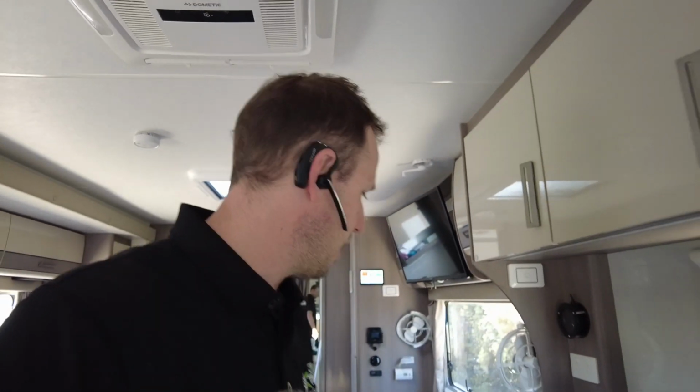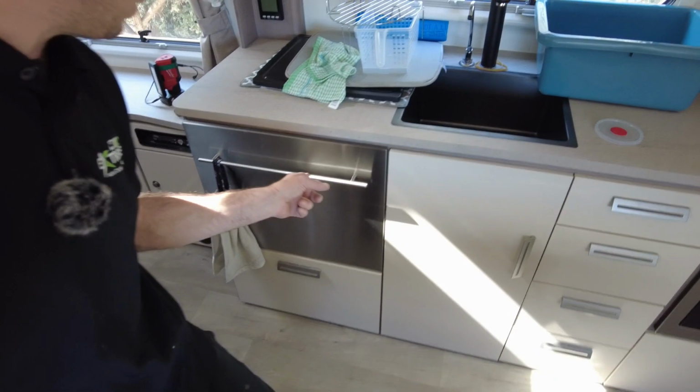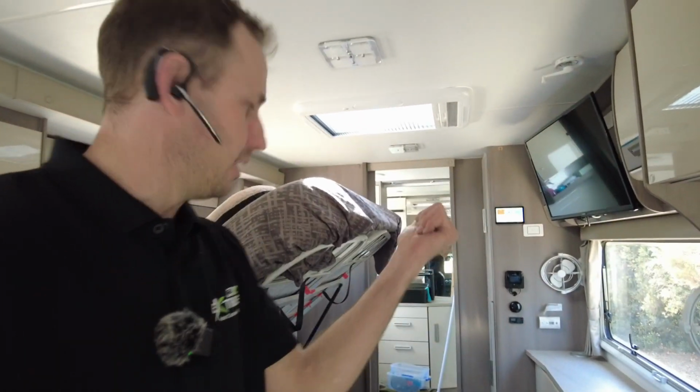560 amp hours of lithium, 6.7 kilowatt hours of storage, 1,000 watts of solar on the roof, MPPT 150 smart solar, 120 smart solars. That's two smart solar controllers in network. Got the Orion 30 amp DC charger. Got the Multi 12 3120 inverter charger, with that fast chargeability for these guys from the generator and anywhere on mains power and running on all the factory outlets, induction cooker, boiling away, air conditioner, humming away, dishwasher, happy days with that one, washing machine in the ensuite there, anything mains power they want, it's all able to be used, microwave, off-grid, so enjoy.